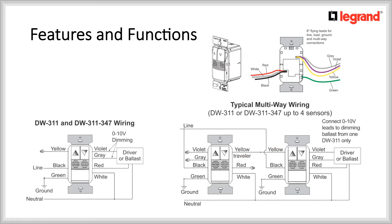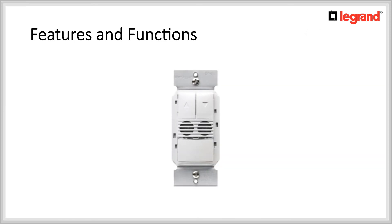You can turn the lights on or off and dim at all locations. For the occupant, this will be very easy to operate. If the motion sensor was set to manual on, they will tap once to turn the lights on, then press and hold in order to dim up. If the sensor was set to auto on, press and hold to raise the light level. The button on the right will function the same way: tap once to turn off the lights, press and hold to lower the light level. There is a red and green LED which will blink every time it detects motion. They are also used in advanced programming, which I will explain in a minute.